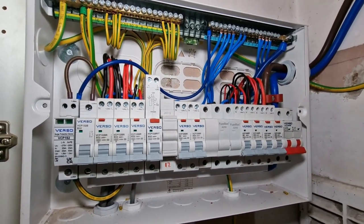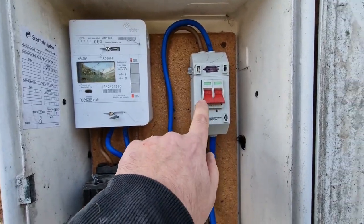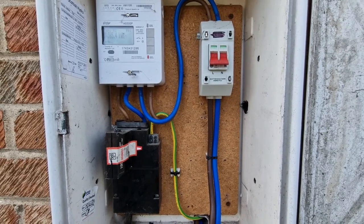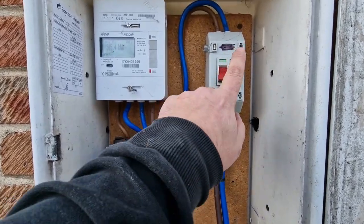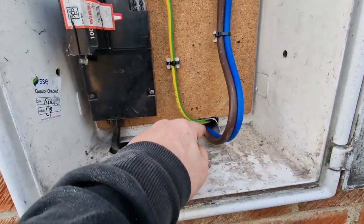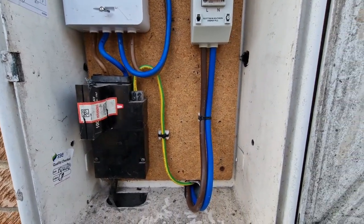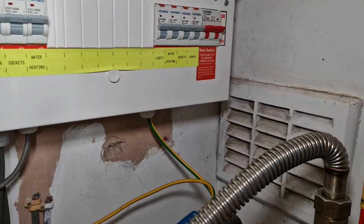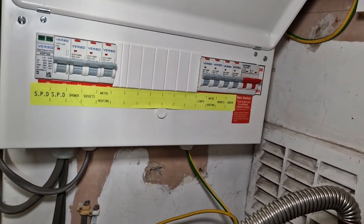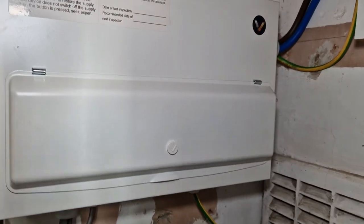We've got the AFDD to drop in on our final circuit in a minute, but we're going to run through the dead tests first and get all this labelled up. You can see we've got this isolator switch here which we've had in the off position - just connected these tails up and we're all done inside. We can now get the power restored and do some of the live testing. We've updated these tails and luckily we had a tube through. We've got all new tails through to the head and the new consumer unit inside. Circuits are all labelled, main switch down at that end, RCBOs all in - some pushing blanks as we're waiting for some of the DIN rail Verso ones.